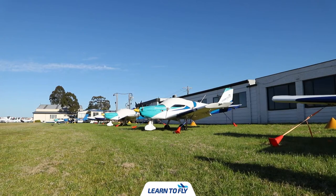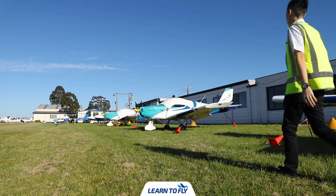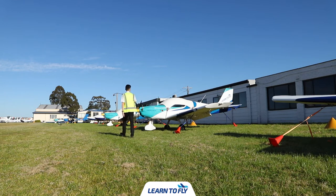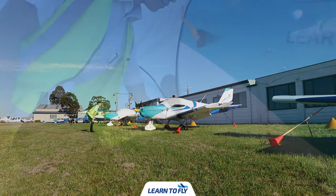Your pre-flight inspection starts when you are walking out to the aircraft. When you approach the aircraft you should visually check the airplane for general condition, and it should be parked in a normal ground attitude. If the wings are not level or are dropping to one side, look at the tires — there's a possibility that a tire is flat.